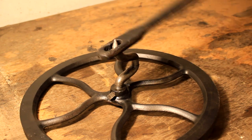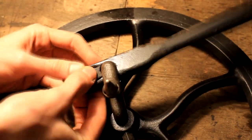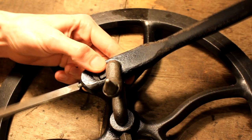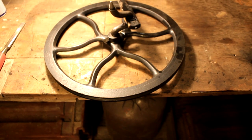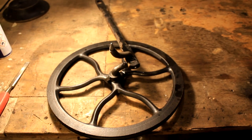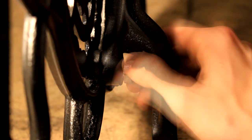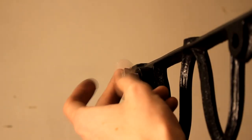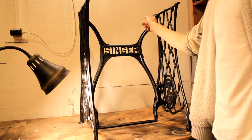Now I'm working backwards, so the next on the list is assembling the crank. I'm putting all these components in place as I found them — they look a bit worn but I didn't want to replace any of them, since I wouldn't know if I got the fit right, and I want to keep the original components. If they break in the future, I can fix them then. The frame is held together by just four nuts and bolts, which I screw together and tighten with an Allen wrench. I didn't want to paint the small nuts and bolts since that would mess up the threads, so I smeared them with machinist oil to prevent oxidation.